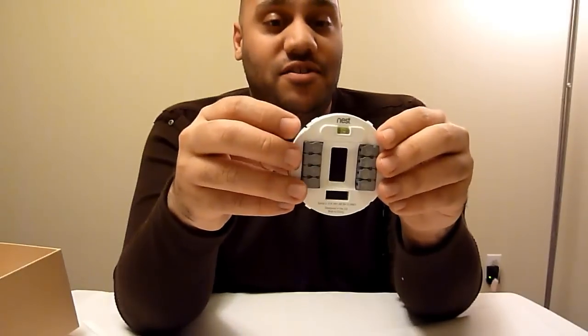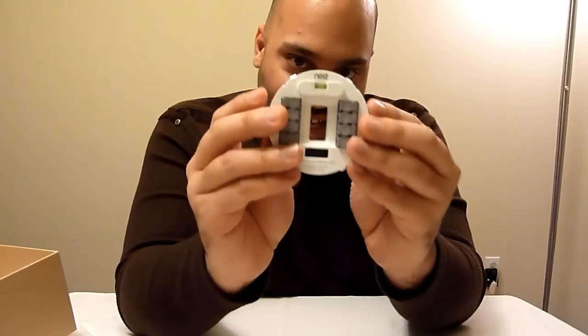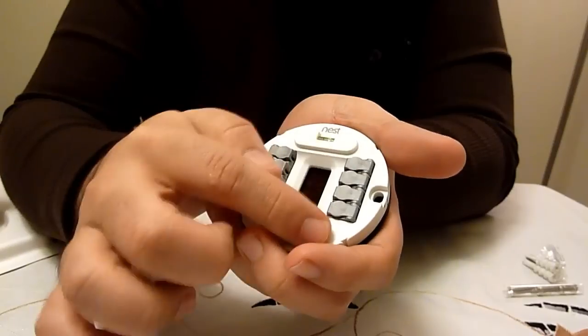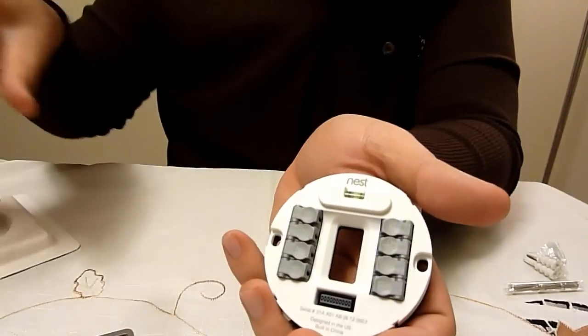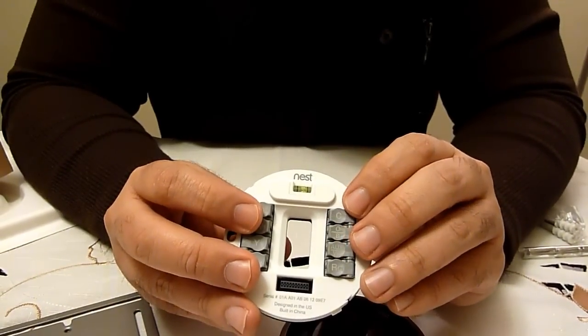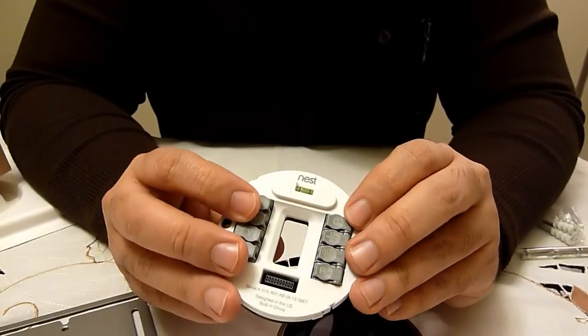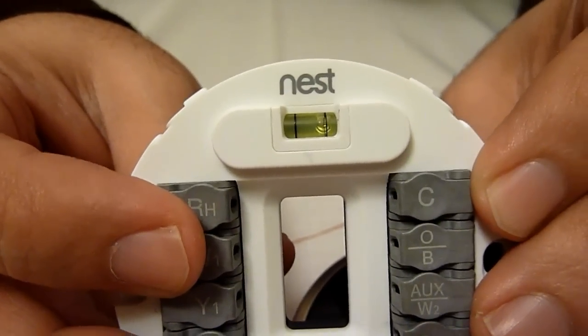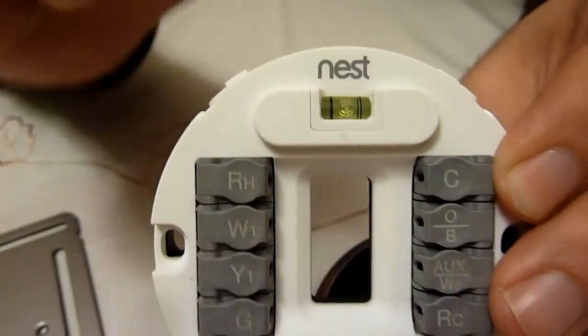This is the very important part because it's what's actually going to connect to your wires. You remove your old thermostat, put this against your wall, screw it in lightly, and match up the wires — push the connectors down, put the wires in, let go. Make sure you put the right wires in the right holes, and that's why they gave you those stickers. Here's another nice touch — it's a level, built right into the backing plate. So you can make sure when you install the Nest it's perfectly straight before you screw it in tightly.